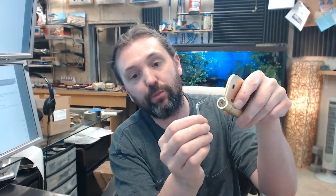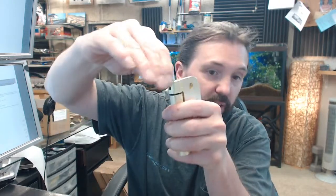Now, being a spring hinge, this hinge from Hager will include an Allen wrench. This is the top of the hinge. It will have the Allen wrench preparation in it. This is the bottom. It doesn't have that. So when the top of the hinge is installed, the Allen wrench tension collar, as it's called, is installed towards the top of the door, and they can be used in either fashion, either hand, left or right. You insert the wrench and rotate it clockwise.